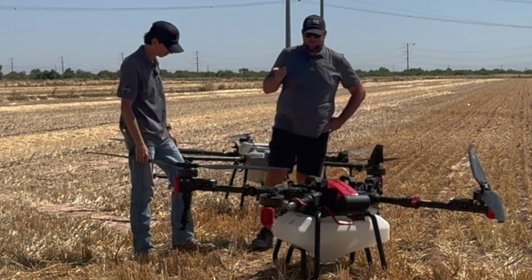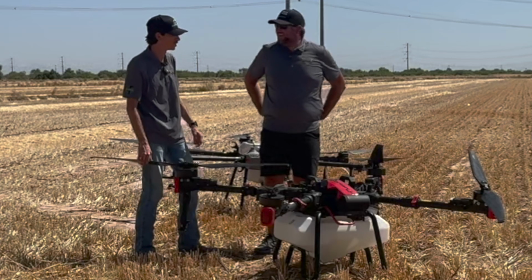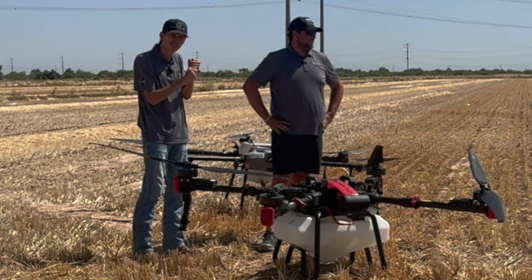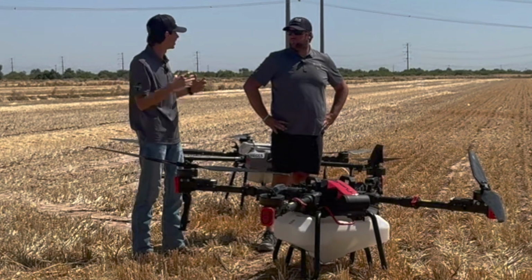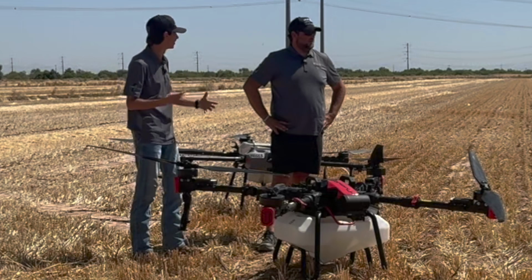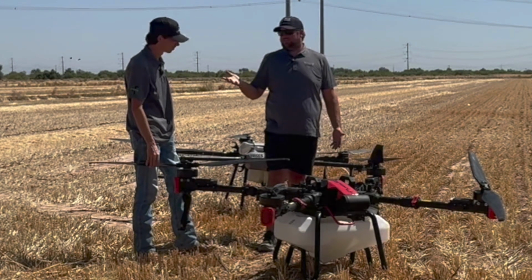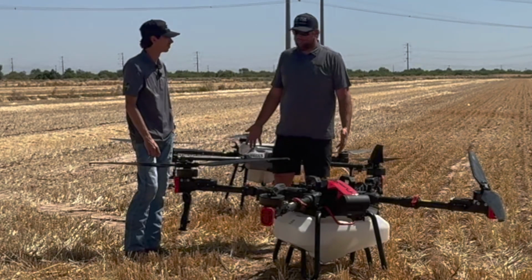If you've flown a T40 for a season, you definitely know what a spray rod adaptive shaft is, and you've probably changed them out. Changed two right before we came out here. And yeah, those are a big thing because they are made of plastic and there's such a small locking mechanism in it that when it does get pushed or something and it pops out, once you've kind of broken that edge of the clip there, you've broken it, and it's just going to sit there and dangle, or you'll push it back in and you'll do 2 flights and you'll come back and it's dangling again. Or gone. Yeah. And I've had customers lose them completely. I've had customers where it banked or turned and it actually flipped the nozzle up into the props and caused an accident. Yeah. So once those pop loose generally you replace them because they never seat back tight enough.